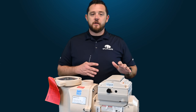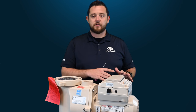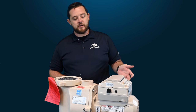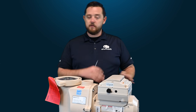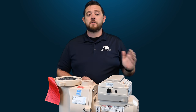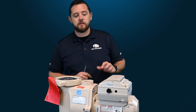First thing you're going to do, obviously before you start messing with any electricity if this is already hooked up, flip the breaker off. That way, as you guys are starting to unscrew the screws, you don't hit something — the power location is underneath this panel. If everything is not tight like it should be, you don't want to take the chance of blowing anything, as well as shocking yourself. So just flip the breaker, turn the power off to the pump.